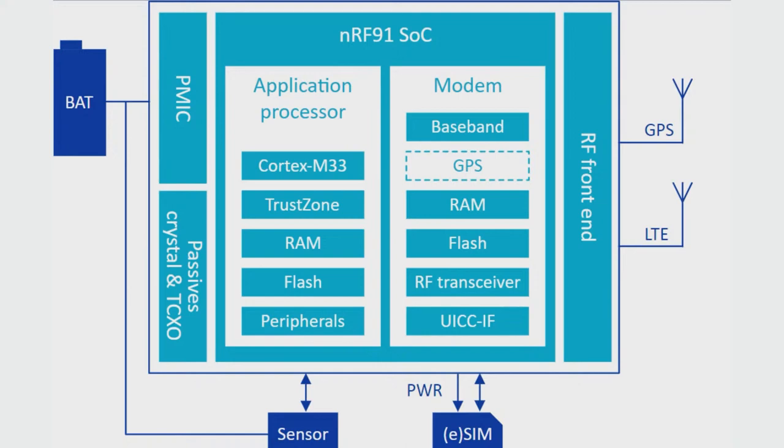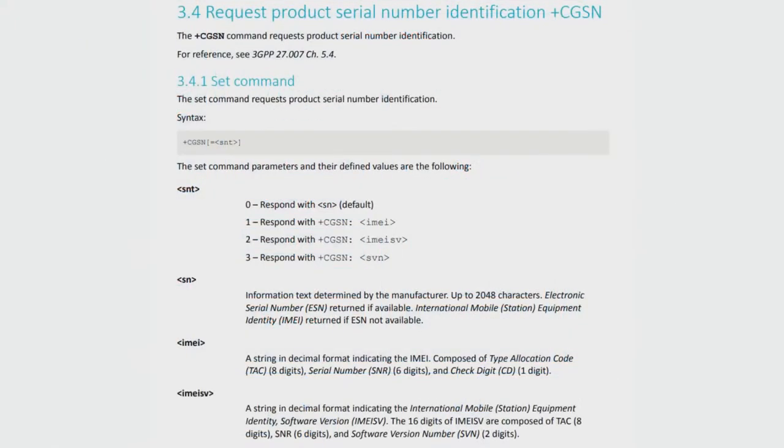You don't have to have two separate chips if you want to get some sensor data in, process it, and then send it over cellular, or receive cellular commands and control some motors — you can do all of that in one device. The modem is communicated with via AT commands. You don't have to port the AT command parser on your own — they give you software support for it. Like any cellular module, you communicate with AT command sets to tell it what to do. It has all the things you expect: connecting, disconnecting, a socket data interface that is separate from the command interface, which is a nice touch.